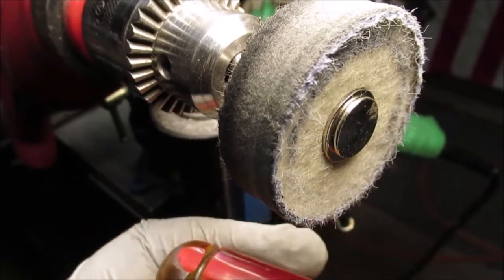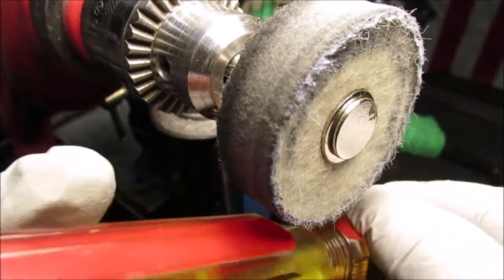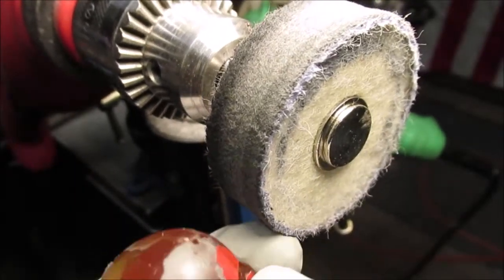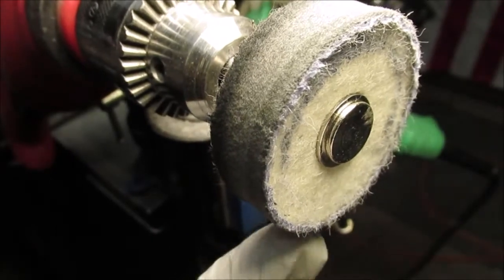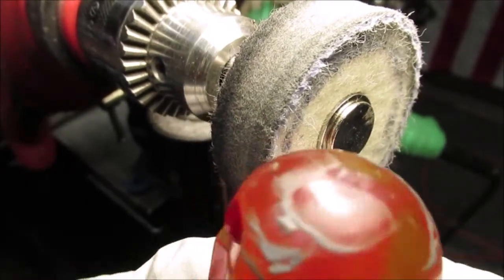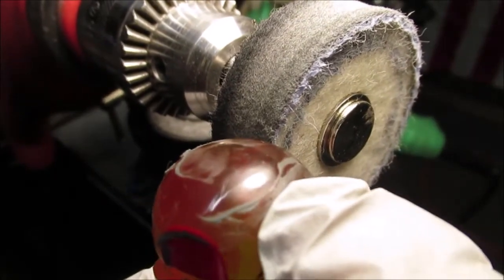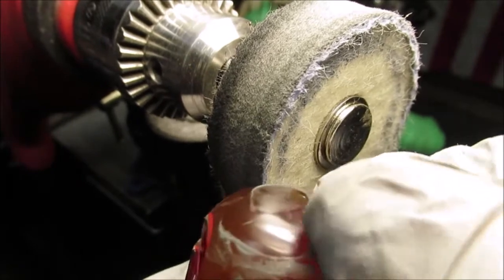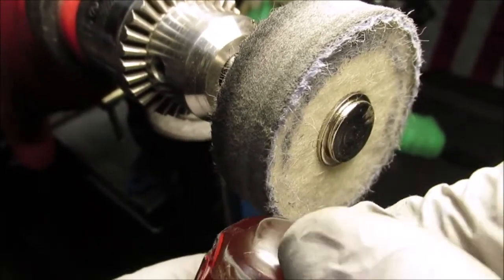And then we're going to go to our bigger one, and we'll be really careful because of the paint, but we will be buffing even the paint. See this stuff stuck there? That's polish that's gotten really hot and stuck to the plastic, because we're really trying to get the stuff out of there without having to sand it. Any more than that, it'd probably be melted and stuck. That's almost to the point where the polish is melting into the plastic, so you've got to be very careful.